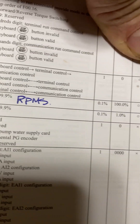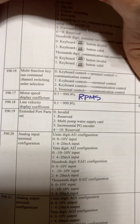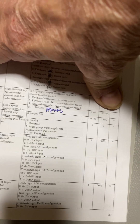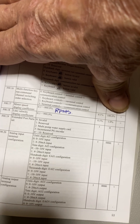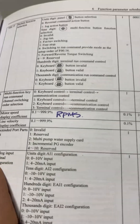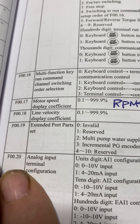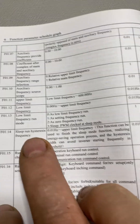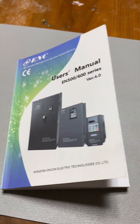That's part one. Part two involves the RPM coefficient, which is F0017 — motor speed display coefficient — essentially a percentage. The factory setting is currently 100. All you need to do is take the motor RPM listed on the motor plate and divide it by the number on your dial, and that gives you the percentage. There is some slip, so you can adjust from there to zoom it in. That is F0017, motor speed display coefficient. There are 51 inputs and up to 14 displays — have fun with these on your drives. Thanks for watching.